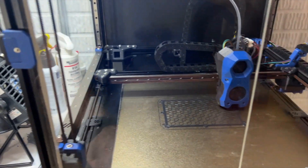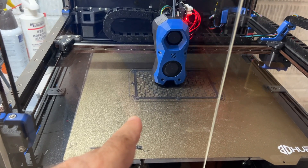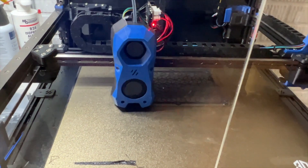You also want to make sure you have a really good seal on your enclosure, otherwise you might get curling. You can see by looking at this printer and this printed part — I've got these little helper disks in the corners, and those help keep the corners down. It's just an insurance policy; generally I don't have problems, but I like to do that.